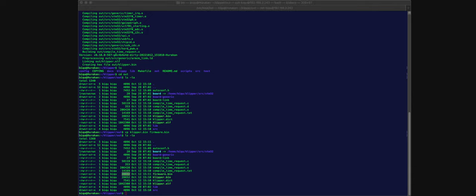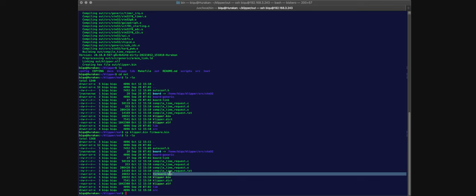Oh, I forgot. When you install the micro SD card on the Manta board, this file will be renamed. Let me check. Firmware.cur. So the extension instead of bin will be cur. Okay. Of course, you need to then configure the serial to the motherboard ID to confirm whether the firmware is updated successfully and that kind of stuff. But all the details are in section 6.3 of the Manta manual. So I'll put the link to the manual in the description. And we are all set at this point, okay?